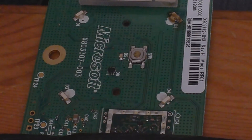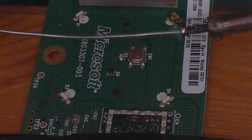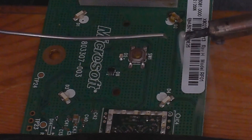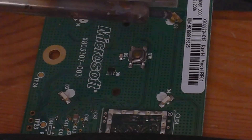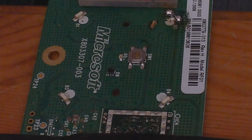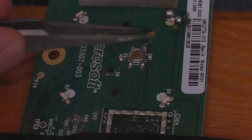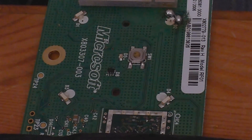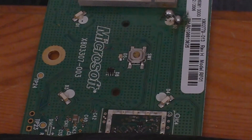So we've got to get rid of our first LED here. Step one: get some solder, put it on your iron first, and you want a fair amount - create a little blob of solder, and with that blob you're going to try to float the LED off the board. There we go, it's off - with a bit of a struggle, but we got it. Grab a pair of tweezers and pick that off. That's our 0805 LED off. That wasn't done very neatly, I'll admit - you'll make a much neater job of it.